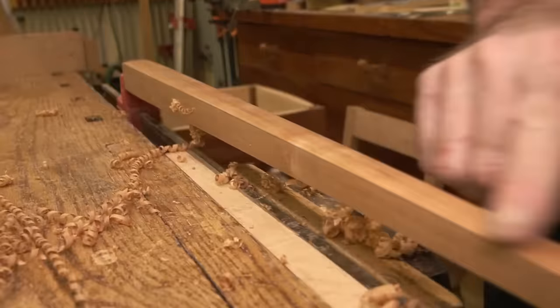I'm sorry. So Ken's curious, would you pillow all sides of the legs? Yes, Ken, I would. I would hit the other side and then the inside, but always stopping short of the joinery area so that you don't make that shoulder connection sloppy looking.